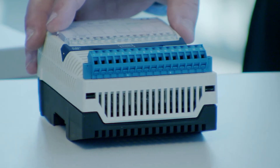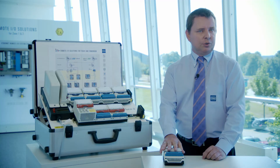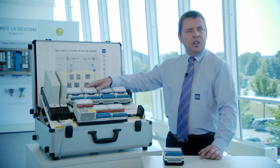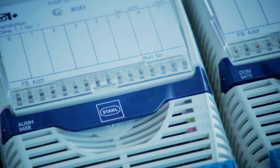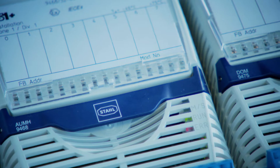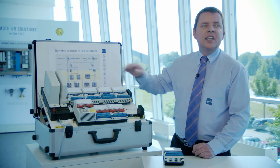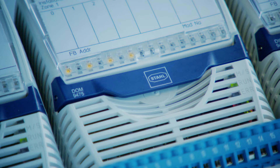The diagnostic package was also extended. Good, reliable diagnostics are becoming more and more important for modern installations. The IS1 Plus modules now come with channel status LEDs for simplified commissioning and troubleshooting. For each channel, a flashing red LED indicates a line failure such as a wire break or short circuit. For the discrete I/O signals, yellow LEDs show the status of the input or output — whether it's on or off.